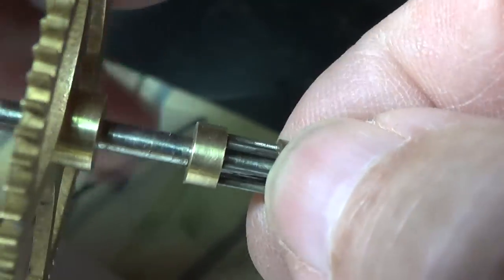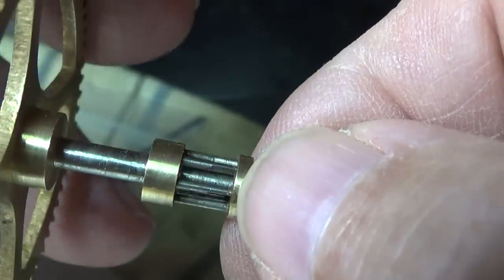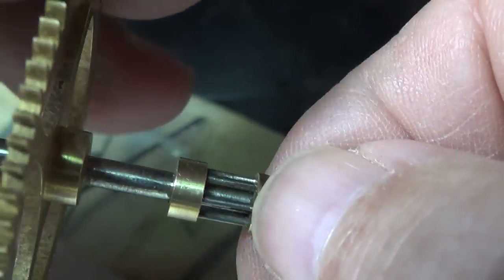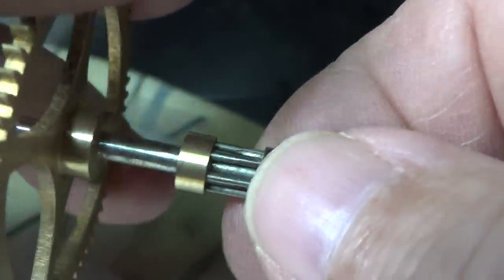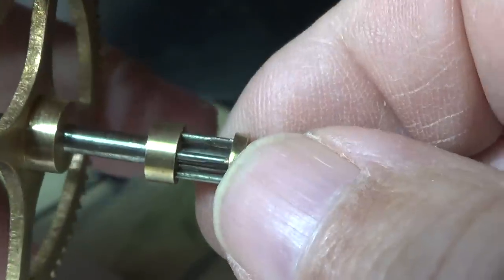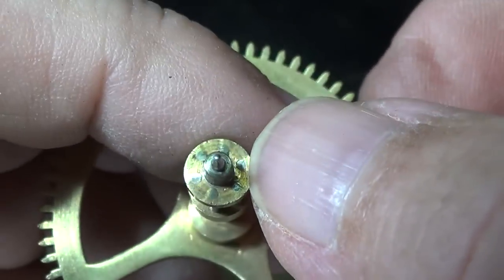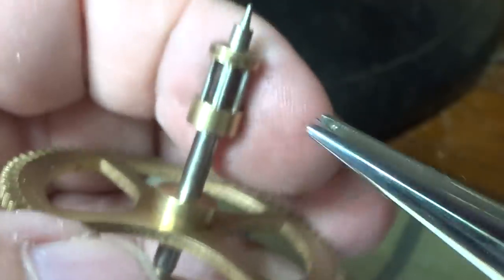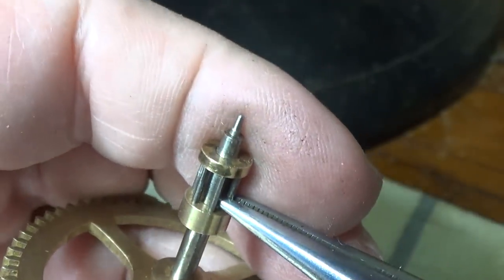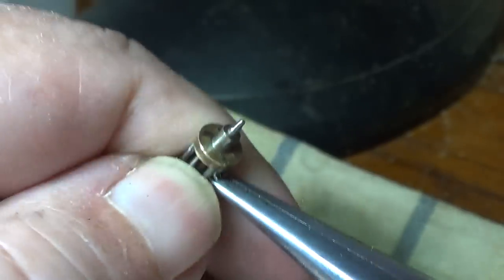I also look at cut pinions. The leaves on a cut pinion don't turn or rotate. So I'm of the opinion that they were never meant to rotate. So I'm not opposed. See how these are flush? I'll bet I can pop those out without even cutting them. I'm going to give it a try on this gear. See if I grab low, push upward.